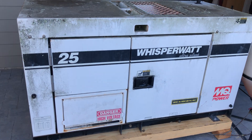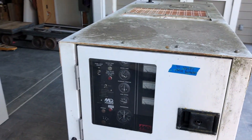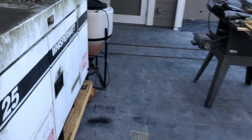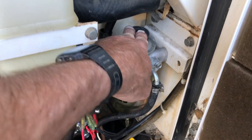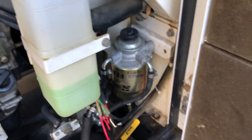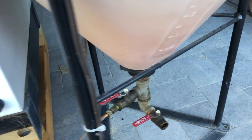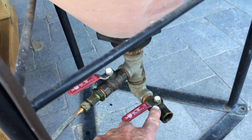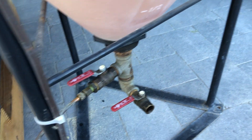I don't know where to get non-taxed fuel so I thought I'd give it a quick test. I fired it up to see if it would kick. I used the prime pump, which is right down here on top of the fuel filter. You prime it using that pump — this is the return line right here. The way I've got my fuel hooked up, any water falls down to the bottom so I can purge it before I run it. I take a look at the fuel to check for water. This is the supply line, and this is the return — it comes right up and dumps back into the fuel tank.